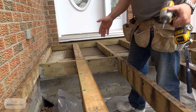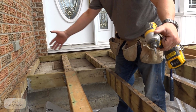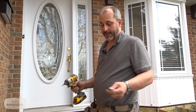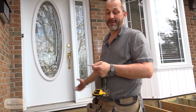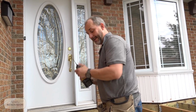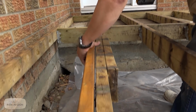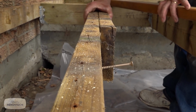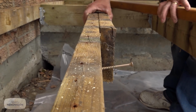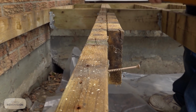So the reality is our joist package that's carrying weight here is only 3.5 feet long. So it's not a big concern that we're using a little smaller lumber there. That's what's there. And rebuilding that means tearing everything apart. And nobody's in the mood for that. This deck's already been here for 20 years and nobody's had an accident. It's just kind of funny because here we've got this lovely 2x6 area that looks like they used scraps to do the job. They've got two of them cut down here and a little scrap in the middle. That's just not gonna cut it, folks.